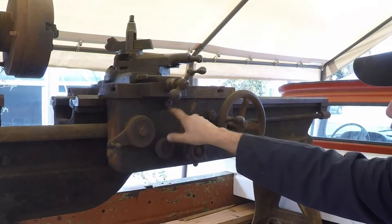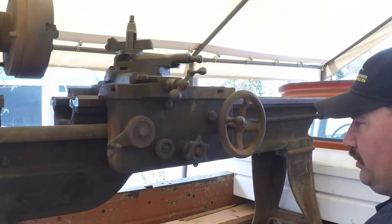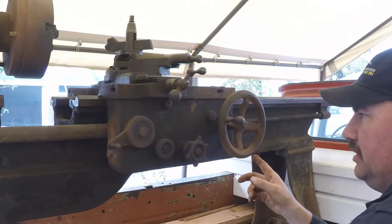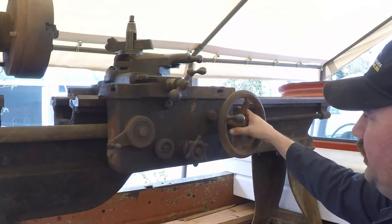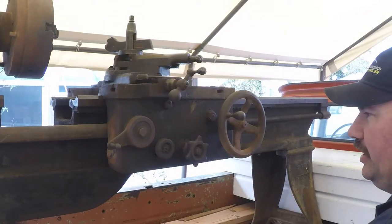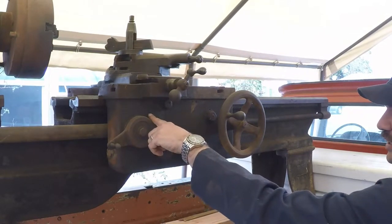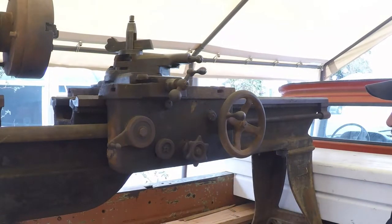All these just have little oil holes in here. I was talking to a friend of Keith Rucker's — Neil Tyson I think is his name — and he has this exact same lathe. He found there's no facility to oil something in the back, and he did a whole thing on how to do that. We'll probably end up doing that too and have it on film. He put little Zerk oilers on there; right now they just have a little hole to squirt oil into.